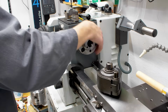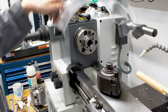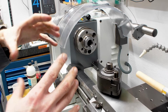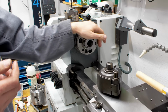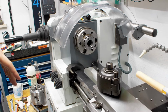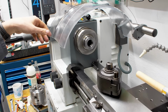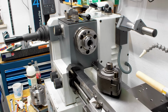Then we have the setting. This is the spindle still not braked. Without a brake, but you turn the motor off, then the brake engages, stops the spindle and disengages again, so you can freely spin the spindle. Then we have a third setting, which is always on for the brake if the motor is not spinning. But usually I like it just like this. And it disengages the brake. That's my preferred mode of operation on these machines.